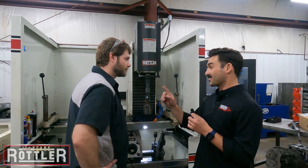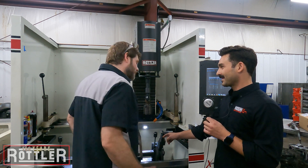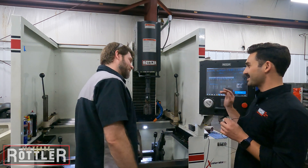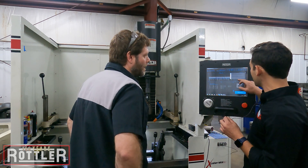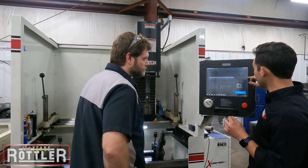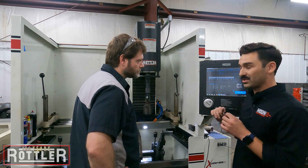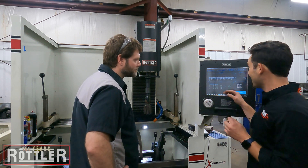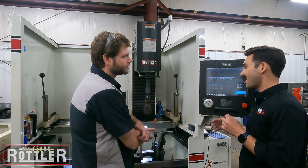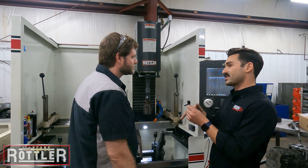And as you said, we can even learn new things. What was the number one question you asked today? You said, we think we have dirt in here. Yeah, it really wasn't getting the valleys — the RVK — deep enough on these stones, and we ended up going a couple things. We spent a couple hours with this software just because we were able to look. What this has is the graph and material ratio curves, material probability analysis, so we can see the plateau. One of the coolest things is how this material ratio curve lines up, and it actually puts a blue line on the scanned profile, so you're able to see a blue and a red line for those curves on the profile — which I think is just awesome. And things that you can't see otherwise — being able to look at it and see these dips and talk about, yeah, that was probably a piece of dirt where the skid wasn't quite able to travel over things.